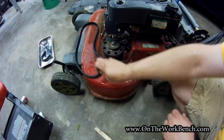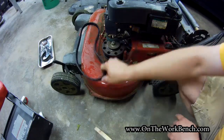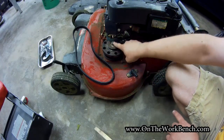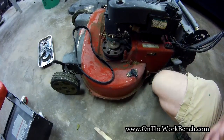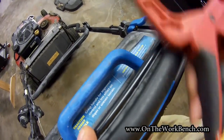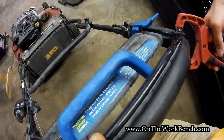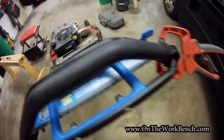One of the next challenges for getting this belt on is the blade brake right here — that's going to impair the belt getting down and around this pulley. We have some options: either undo the lock nut here, or go up to the user drive panel. Coming up to the control panel, we can take a clamp — I'm using a Milwaukee spring clamp — grasp the blade engagement handle, and secure it down with the clamp.